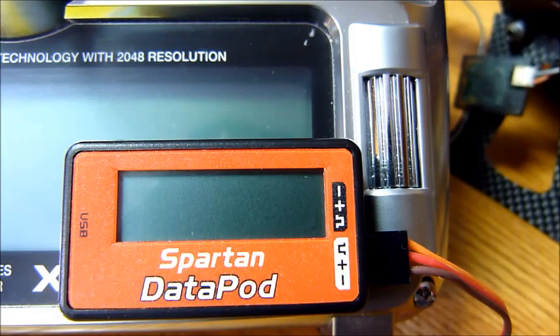If you're using spectrum satellites, you'll want those connected. If you're using a different receiver type, you'll want the patch cables that came with your Vortex connected between your receiver and the left side of the Vortex — that's the same side the sensor is on.